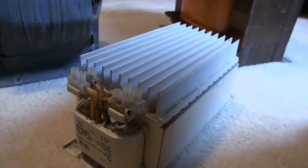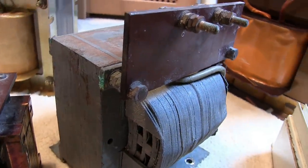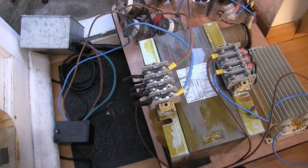We're going to decide what we're going to use for future experiments, but more importantly is how we get enormous arcs and don't manage to burn the transformers out. That's simply because we use a device known as a ballast. A ballast is normally a wire-wound device, sometimes used in series with lighting, sometimes as a reactor. When we use a ballast on the primary, we can stop the transformer being over-saturated. If we over-saturate a transformer, that simply means we're putting so much power in that the core can't be magnetised anymore — naturally then we're going to start burning coils out.